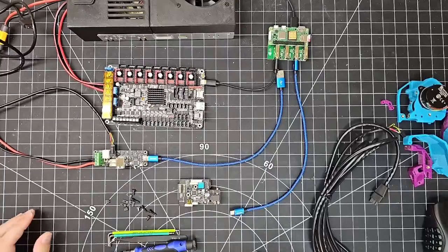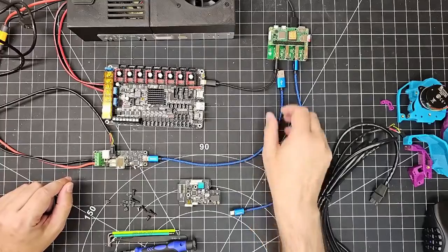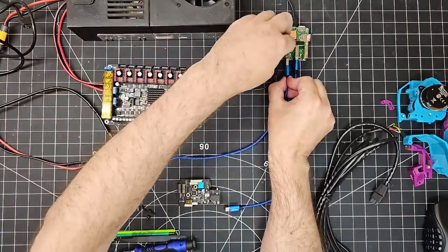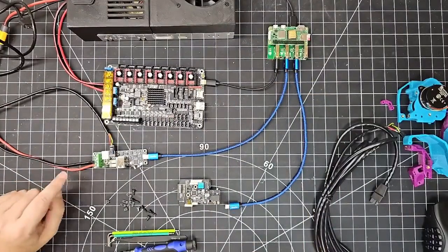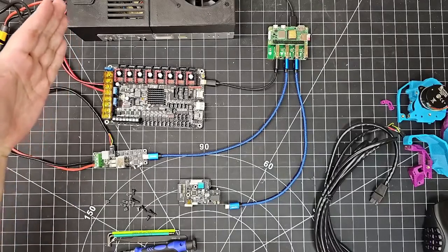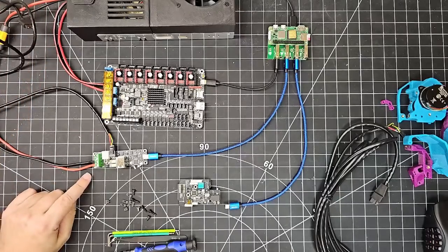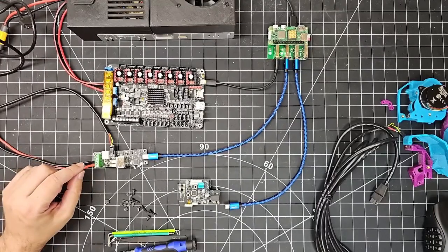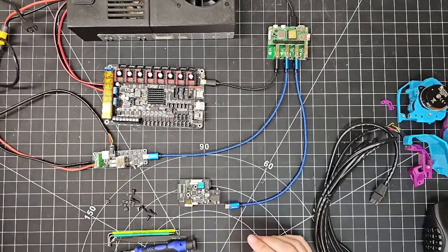So, as I mentioned in the last video, I had powered the U2C previously off of the Pi, and I'm going to reconnect that now back to the Pi. It is also now getting a 24 volt power feed from the power supply. So directly from the power supply's outputs V plus V minus into the 24 volt and ground in the green screw down terminal block on the U2C. And that 24 volt feed is going to power the rest of the CAN bus devices, which we're going to connect